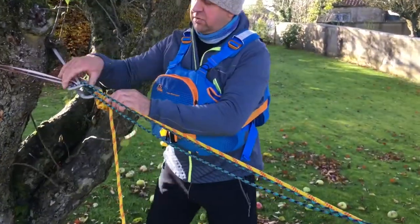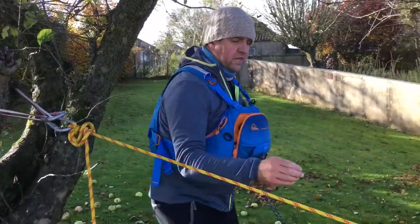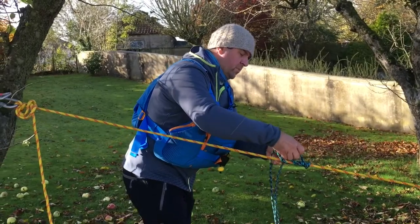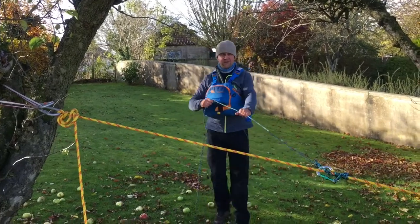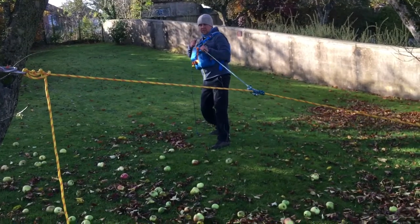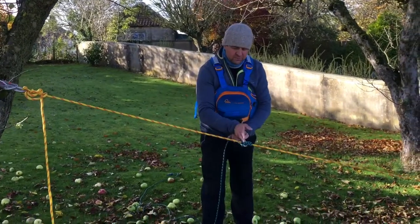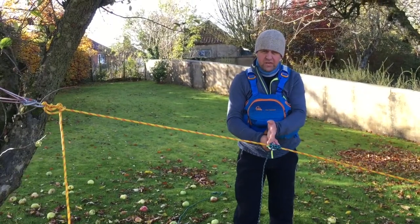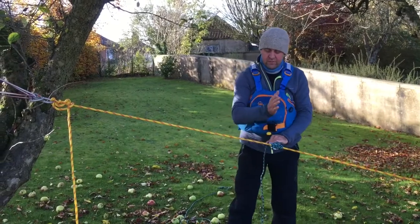And then what I can do is disengage the top section, bottom section, and employ what we commonly know in the trade as a vector pull. If I pull sideways, that will magnify the force from this point to both the anchor and the boat. If I put 100 kilos of force on here, a couple of 100 pounds of force, which is a lot for me, I don't think I could pull that, but whatever it is, if I put a factor of 1 in here,